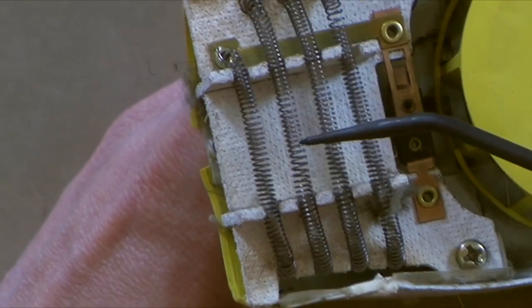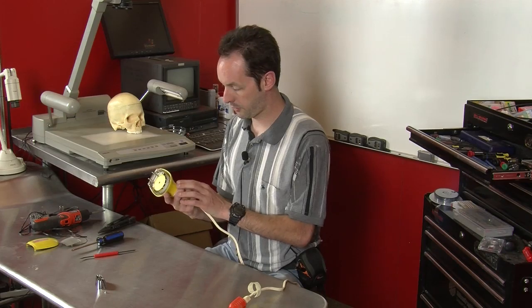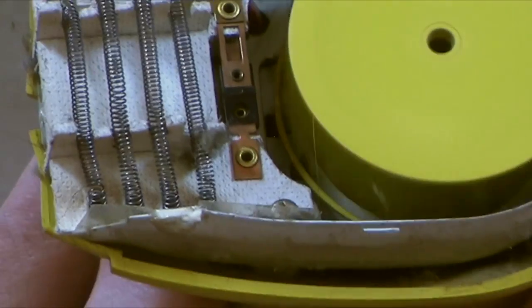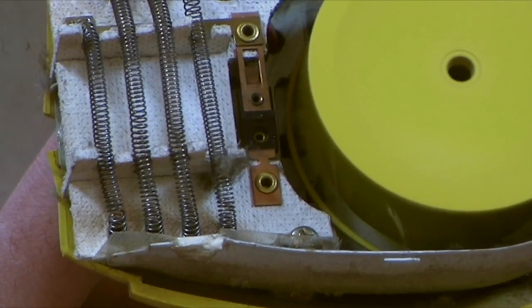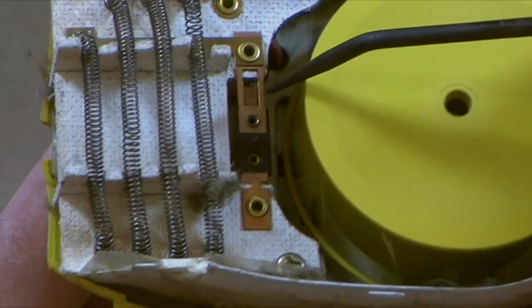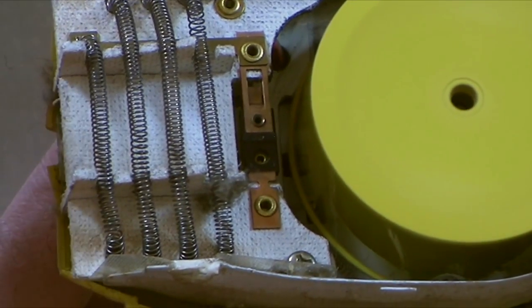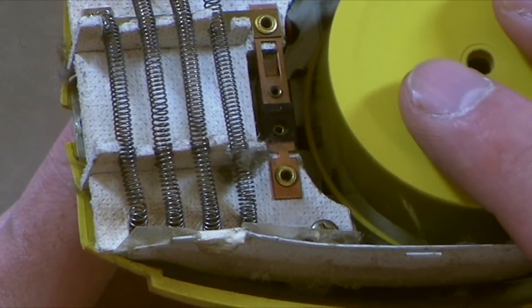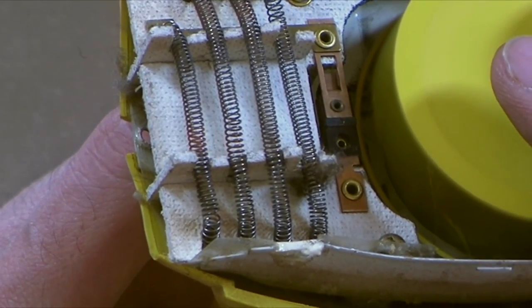These are nichrome wire heating elements. So if I turn this on, let's see, does it go hot first, then cold? Yes, okay. If I turn this on, you'll see the wheel turn. And then the wires will heat up. Now, you can't touch the wires because they're actually high voltage. Where you touch the wire depends on the voltage. This here is the little thermostat or protective heating element, but it's already making hot. And if we turn the motor off, these will get really, really hot and start to smoke. See, they need the constant cooling.